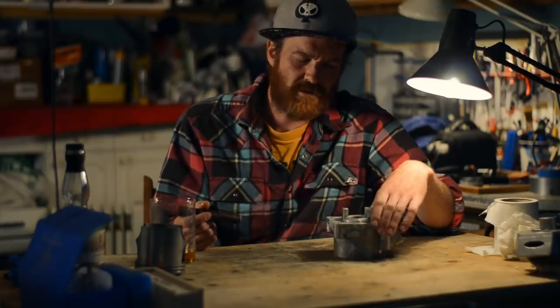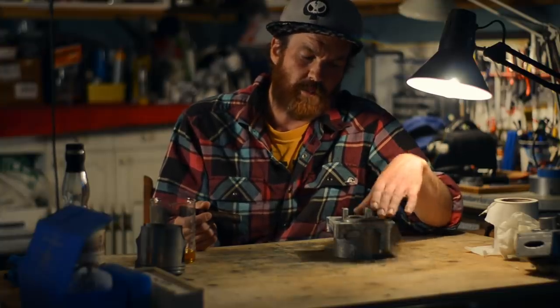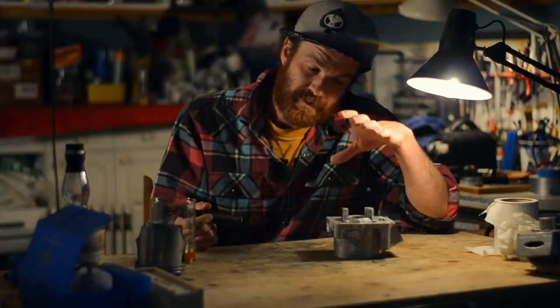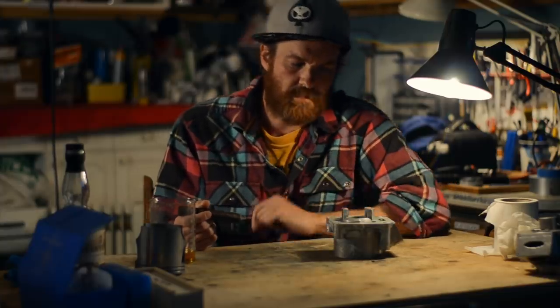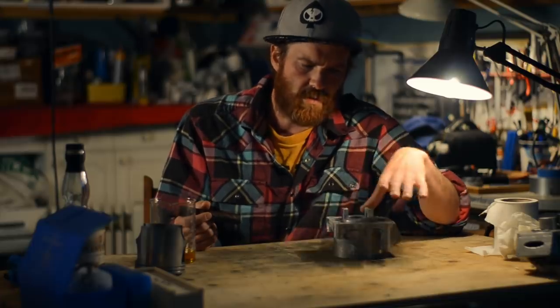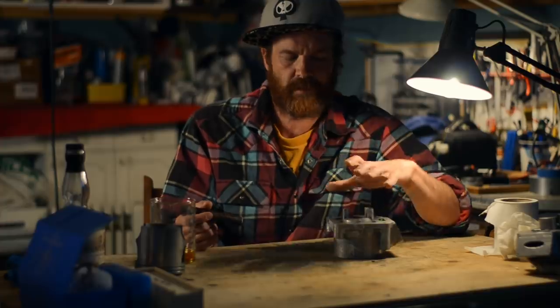And I could run 2.2 amps, so instead of running 1.5 amps for 15 square inches, which this is, I could have run maybe 3 amps, and that would have been okay and led to a thicker coating. But anyways, it looks nice, and let's try honing it.